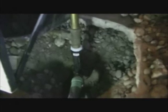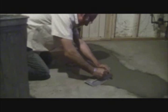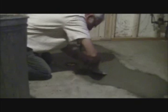After removing the dirt from the trench, dry fit the drain line including the P-trap. I also connected the drain pipe to the floor drain to make sure that everything fits. Once you are satisfied with all connections, glue all connections together. Run some water to test for leaks, and repair any leaks by tightening connections or replacing plastic pipes or fittings.